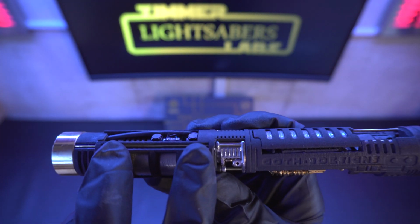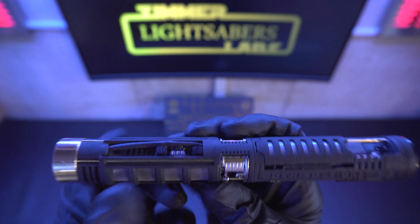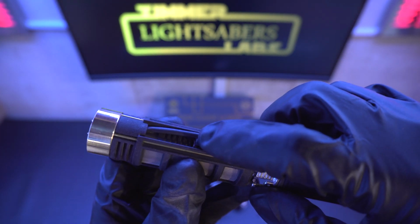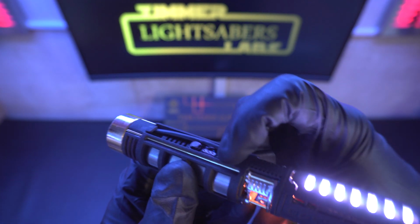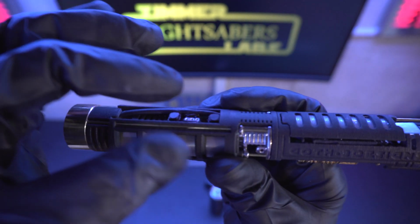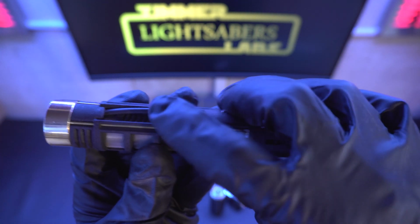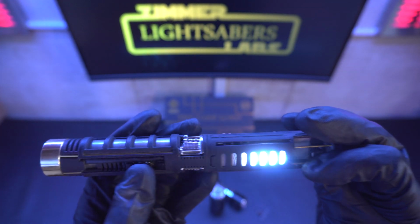These are small 7.5 millimeter momentary tactile switches, plunger style. Auxiliary button here, main power here, and that just makes life easier, so you don't have to worry about plugging in the switch assembly or using tweezers or something to jumper the connectors. You can just use these secondary switches, and that makes life, like I said, a lot easier.